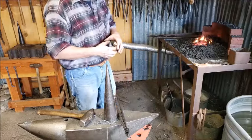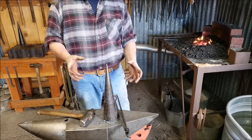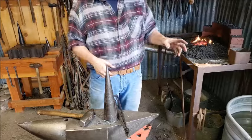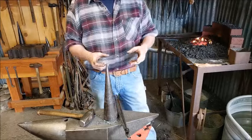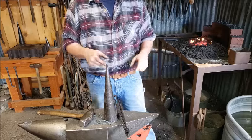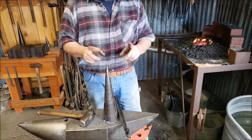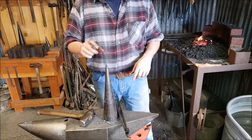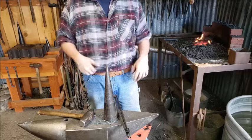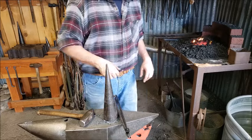And making the ring is just like making a chain link, except I'm going to put it on here and I'm going to make it round. And I measured the ring on the ones I've already made, and it's 1.5 inches in diameter, center to center. So 1.5 times pi equals 4.71. So I'll cut a length at about 4 3/4. I'll cut it a little bit longer, just a hair longer, to make up for the overlap. And then when I make the overlap, it should come out perfect to a 1.5 inch diameter. All right, so I'll get started on that.